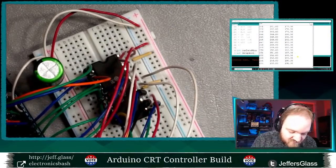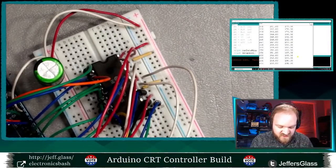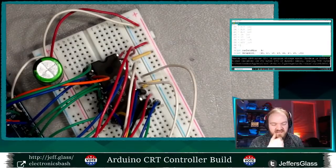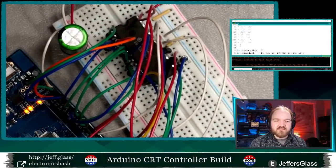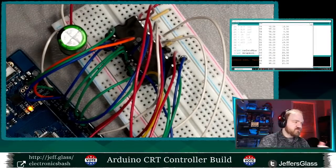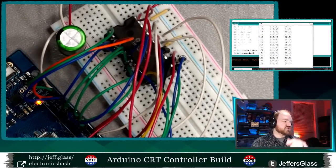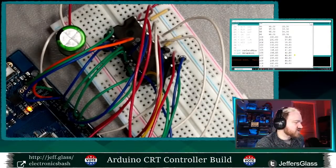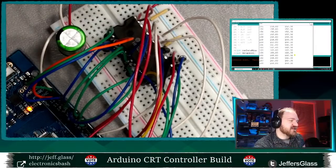start somewhere in the middle of your chain of logic with something that's most likely to be the problem, right? Like in the theater world where we have bulbs going out all the time. If a light is not turning on and should be, it's not unreasonable to start by checking the bulb, even if that's in the middle of the chain of troubleshooting. The odds of it being a bulb are high enough that it's worth starting there.